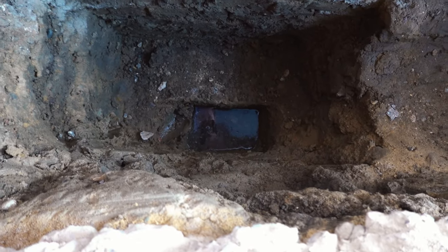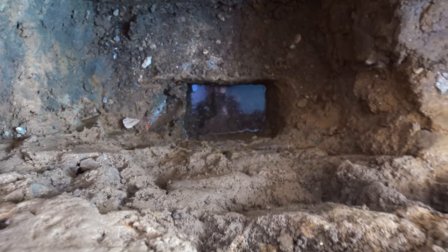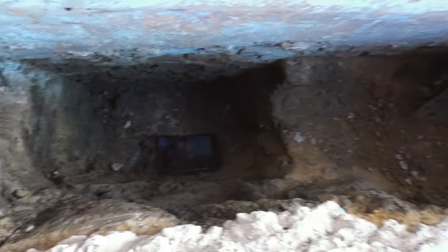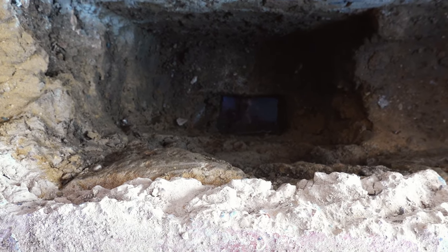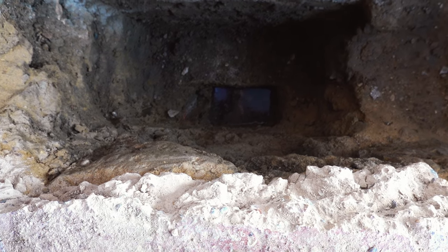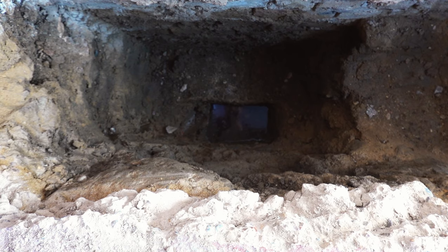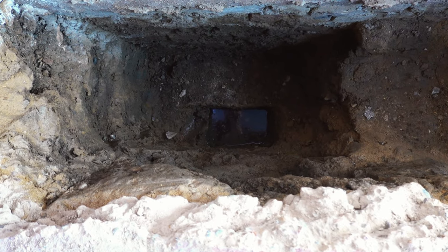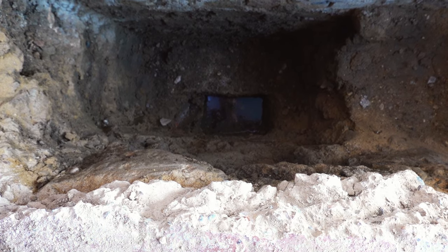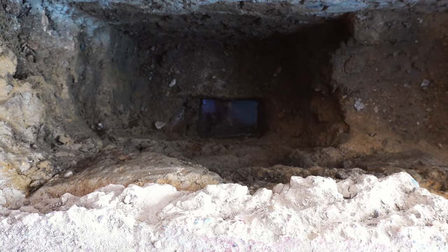But obviously overnight I've had a bit of condensation or a bit of rain, and you can see now my test hole is full of water. So out of all of this trench here, I could have decided to take my sample hole for the footings. I've took it right where the soak away pipe is, has been there for 60, 70, 80 odd years, and now my hole's flooded, so I'm gonna have to drain that out, pack that back up with some clay again so it's absorbed some of the water, and then look at moving my hole further to the garage door.